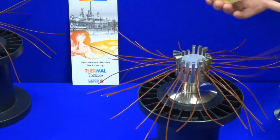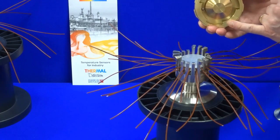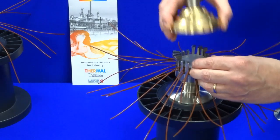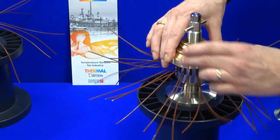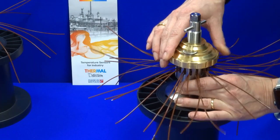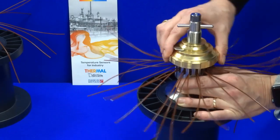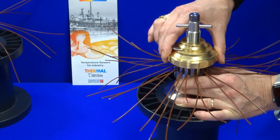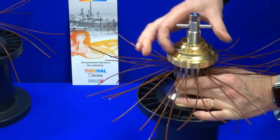The bonnet is replaced by locating the bonnet profile onto the splines until it drops. Rotate until reaching a stop and you should hear a mechanical click. The bonnet is now locked and can only be released by lifting the plate, just as we did earlier.